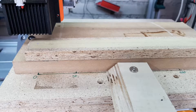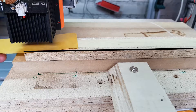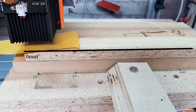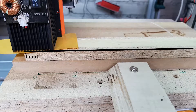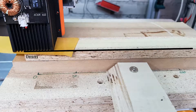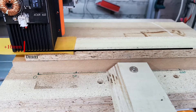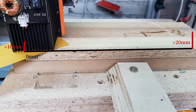But now I thought it's time for a more scientific approach. The idea is to measure the distance when the laser is in focus by checking it on a long straight cut. First of all we need to zero the laser, but now instead of using spacers we have to use the laser itself, just like with all the cutting bits on a router. If your laser has a focus distance — in my case 17mm — we can start from 10mm and finish at 20mm from the surface. We just need to be sure to start below and pass the focus distance.